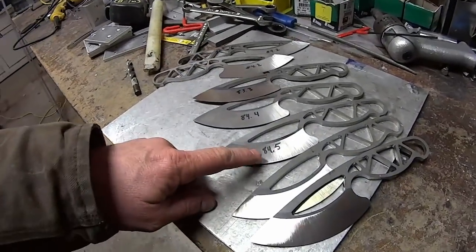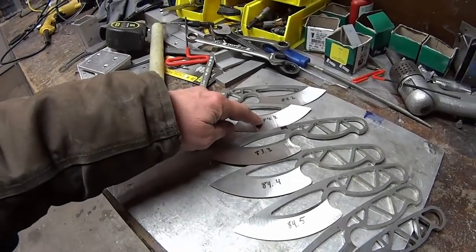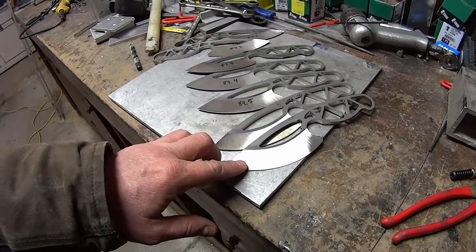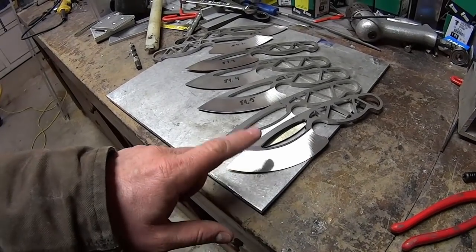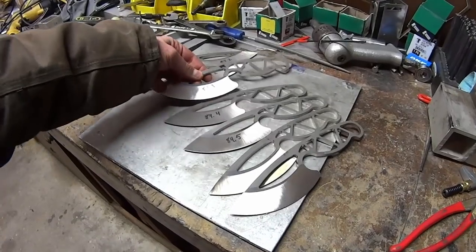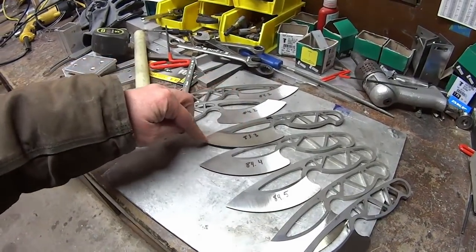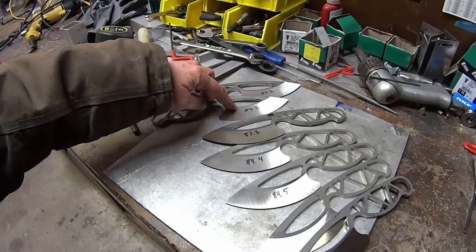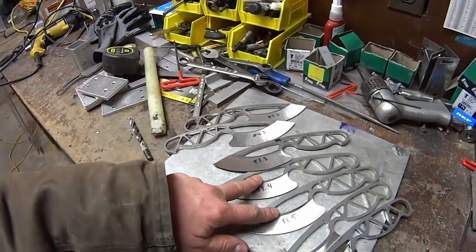You can see I started out at 84.5 degrees, then 84.4, 84.3, 84.2, and then these two down here ended up at 83.3 — I took a jump down, working on getting the line where I want it at the same time that I get the thickness where I want it on the flat grind. 83.3 is going to be the number — there's one marked up 83.3 — that gives me the edge thickness I want for pre-heat treatment when I get to the target I want on the side. All of these others are higher, so I can just put them back in with the platen set up for 83.3 and re-grind them.